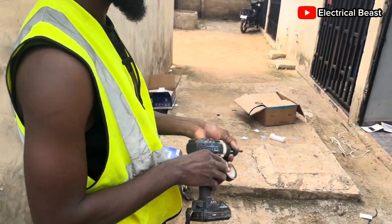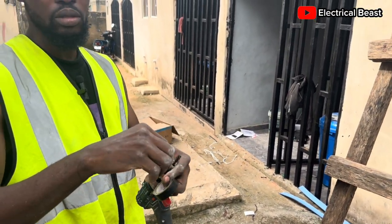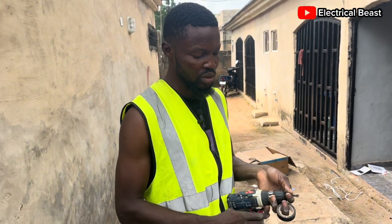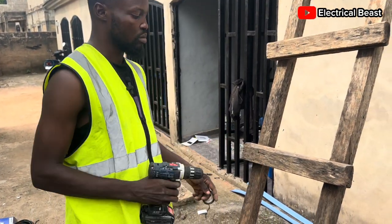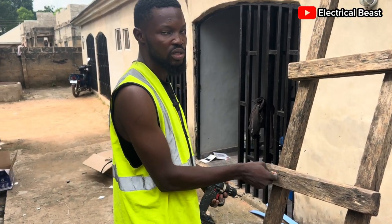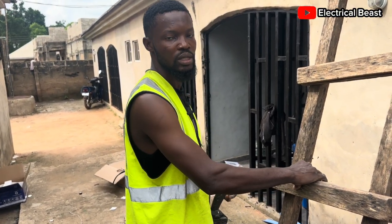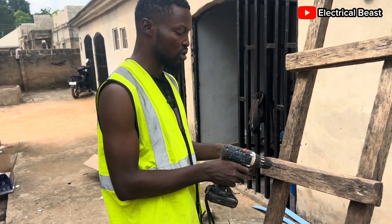Just go something like this. We are going with the screw — just a small screw like this. Make sure you go with the washer. All you need to do is peel off the insulation from the wire, then take this part down a bit. Remember, there is a washer here. So you can twist the wire first, then screw it completely so that the washer and the screw hold the wire tightly to the profile. I've already done that — I'm just trying to demonstrate it to you.